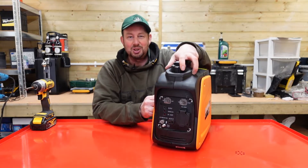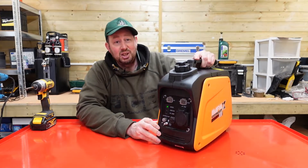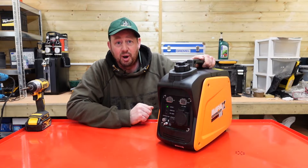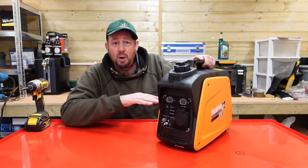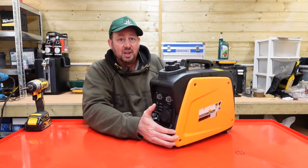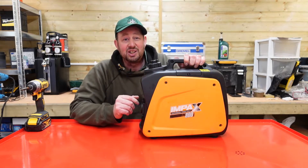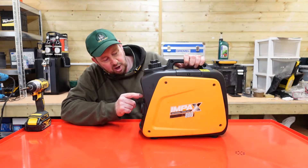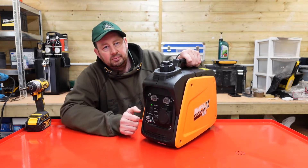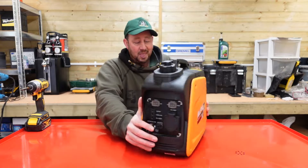They're a bit difficult to start when you're sitting down because you're trying to keep some pressure on the top, but we'll have a go. There you go — it's running away and running quite fast because it's on choke. Turn it from choke to run and it lifts up, drawing more fuel through. Press the eco button and the revs drop — that is basically the generator running on tick over. You need it on a fairly flat surface and the exhaust pointing away from where you're sitting. I don't recommend starting these up inside; however, we have ventilation and extractors in this purpose-built workshop. To stop it: take it off eco first, then stop it. That's your starting procedure.